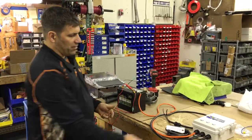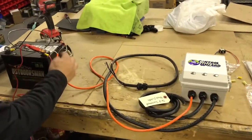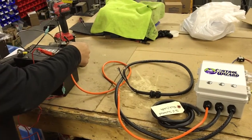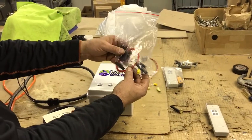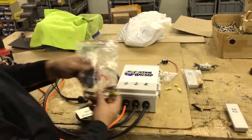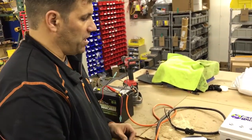I'm going to start over here at the battery. Coming out of the Control Wizard, we have an orange cord here. This is your power to feed the Control Wizard. So I have the white wire, which is going to be your positive lead, and the black wire, which is going to be ground. It does come with an inline fuse that you would put with it — it just crimps right on the end, and you have the eyelets to connect to the battery. I don't put that on beforehand because if you need to make this wire shorter or longer, you would end up just cutting it anyway.